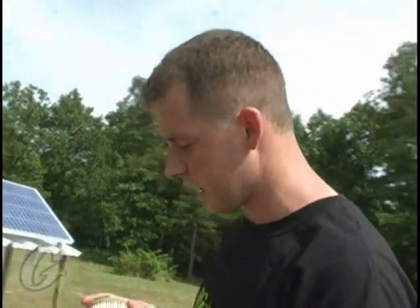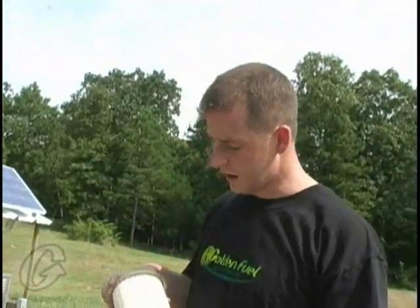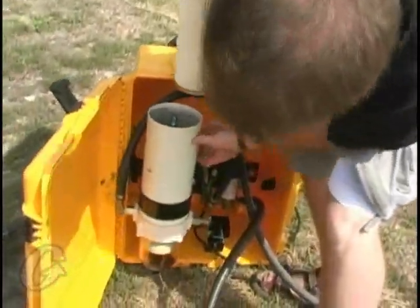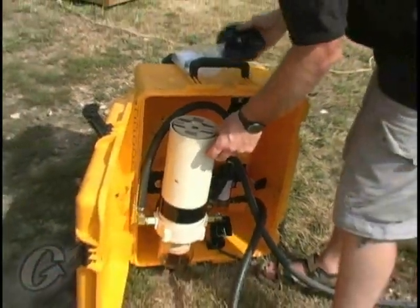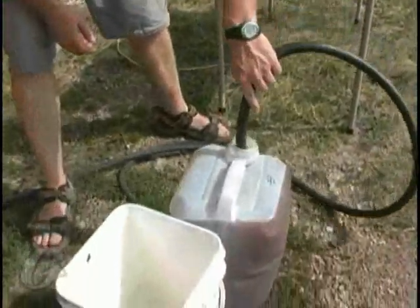Although this is a filter element and it's not magic — if you pump pure water you can't get good fuel out the other end — it's been our experience that they will strip out a significant amount of water. Whether it's free water with stratification or water that's kind of mixed in with the oil like we saw on the pan test. We've got an empty filter here — the bowl doesn't have but just a drop in it — and I'm going to put a new element in and screw the lid on.